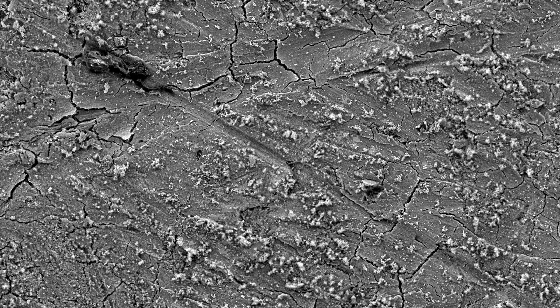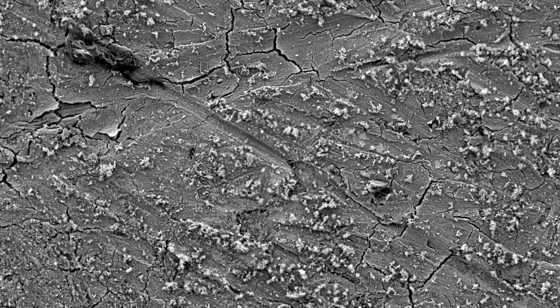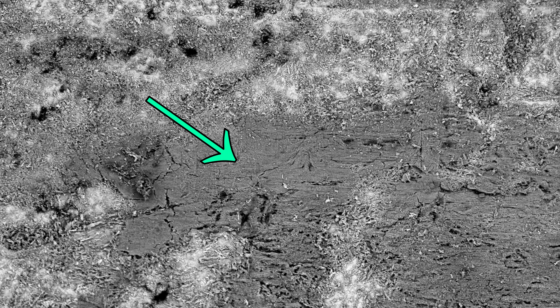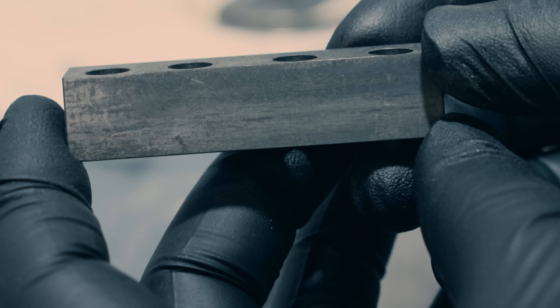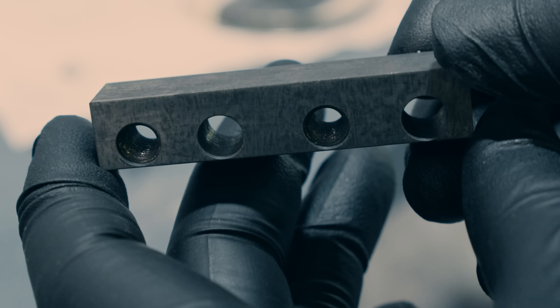Unfortunately, we can see that the coating is just very inconsistent and patchy. Some locations look like big smooth sheets with cracks through the middle. I suspect the underlying metal here was too smooth and I didn't scratch it up well enough, causing the phosphate layer to grow as a single sheet without much roughness. Since the point of the coating is to be rough and porous, these smooth sheets are unlikely to help much, and they also look like they would flake away pretty easily. There's also a big variation in crystal size — some areas are very fine and needle-like, while others are kind of blobby and mushroom shaped. And some spots just don't seem to have much coating at all. All in all, these honestly don't look that great, either by eye or under the microscope. So I decided to strip the parts and try again.